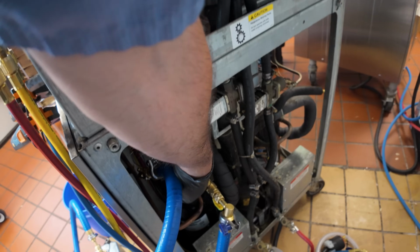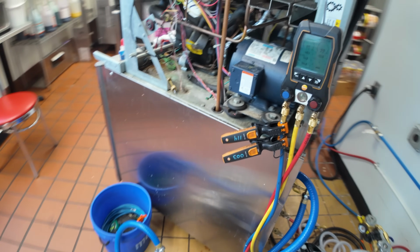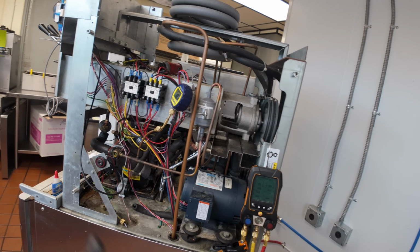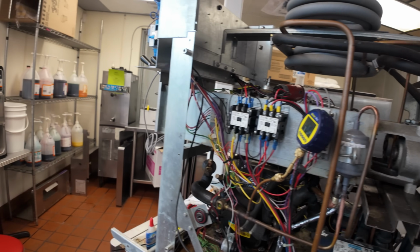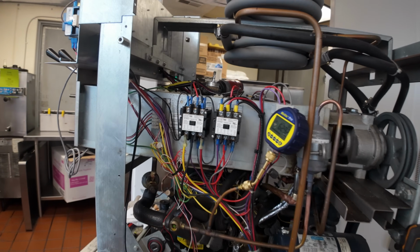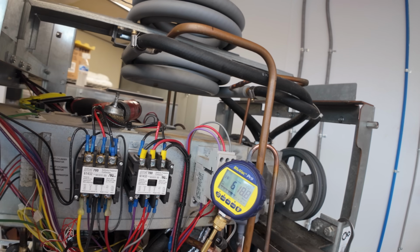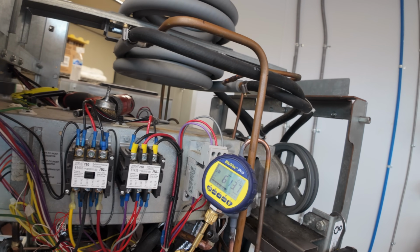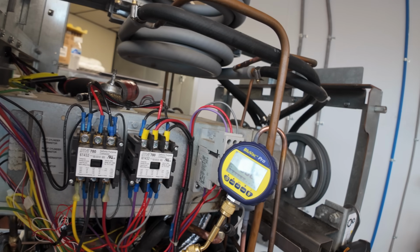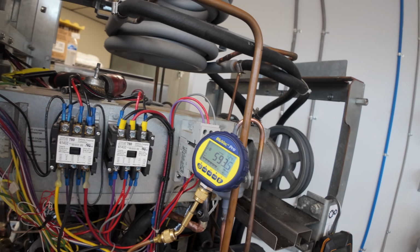I get to see so many write-up sheets from other guys that always say, pulled to 500. Well, that's great. You pulled it to 500, and then you didn't check it after that. It could have gone right up to 10,000. You have no clue. So that's kind of being a little extreme, but the point is, the valve off is the most essential part to see whether or not it actually holds. It's not really the best way to do a leak test, but it does tell you whether you're dry. It does tell you that you're actually holding, so you probably are leak-free.